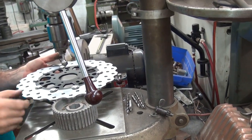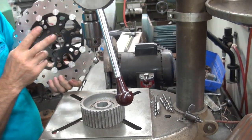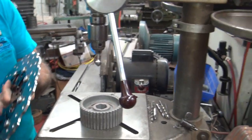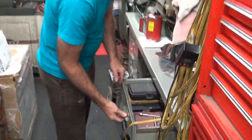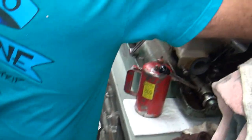That's it, I lost count though — now these are all equal. The centers can be made out of anything, but aluminum is lighter so you make them out of aluminum — rotating mass. Now this here — you've got to deburr all these. By hand? This you can do with a grinder or a file. But you are going to have to stone the surface here because there are lips here. Stone the surface. The lubricant for the stone.